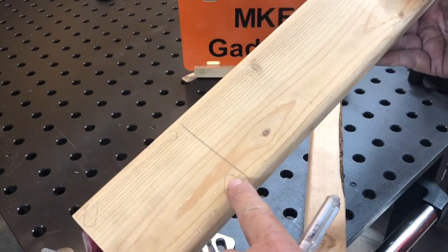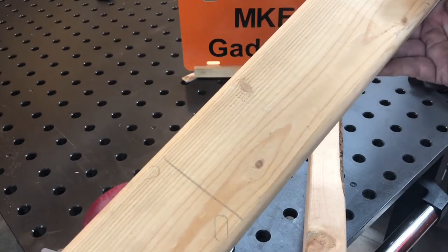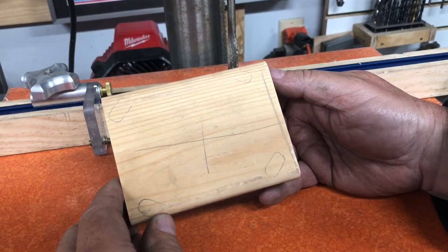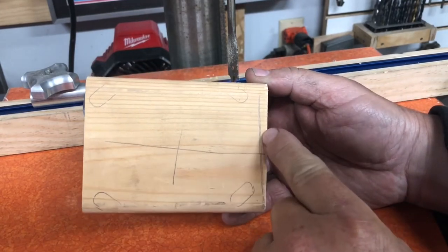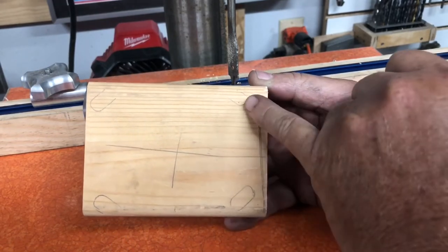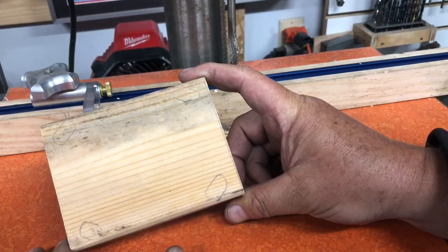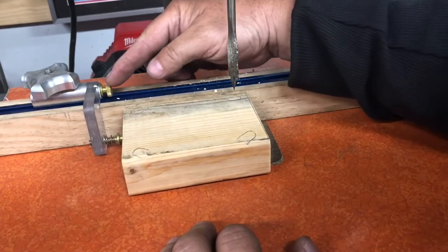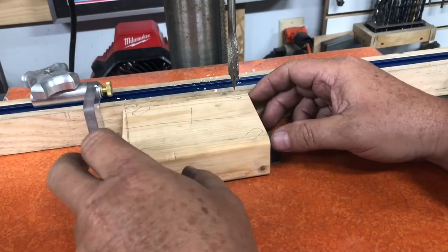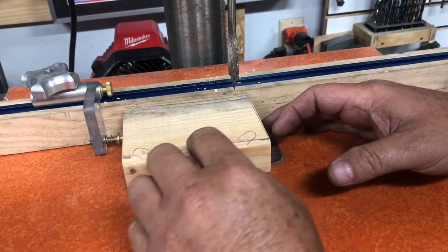You can kind of see the lines there. I'll cut this on the chop saw and then we'll go over to the drill press and drill these out. Between shots I noticed I had my 2x4 on an angle and some of the markings weren't centered well. After I edited it I redrew the lines to get them more centered. With my fence set and my stop set, all I should have to do is drill this hole, rotate it, flip it around, and drill those two holes.